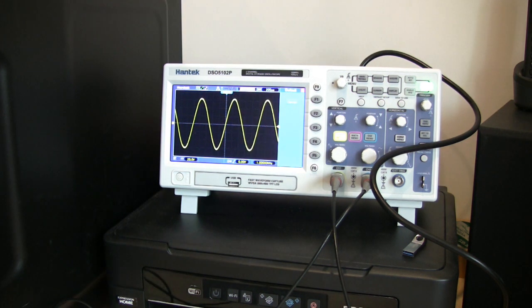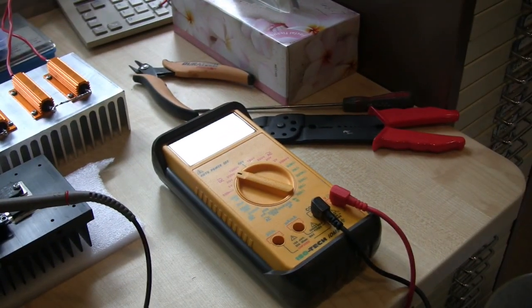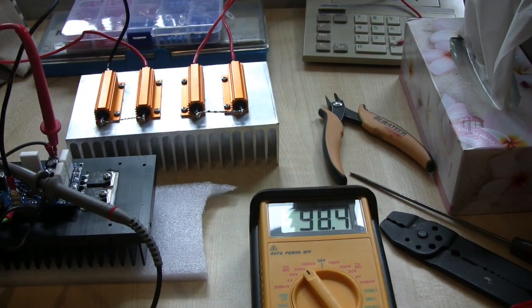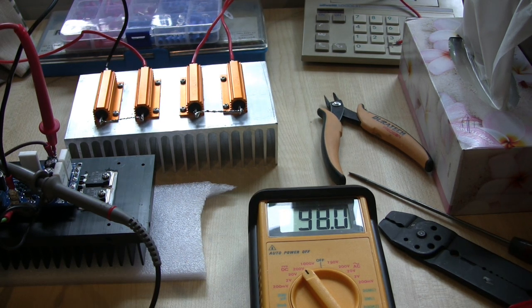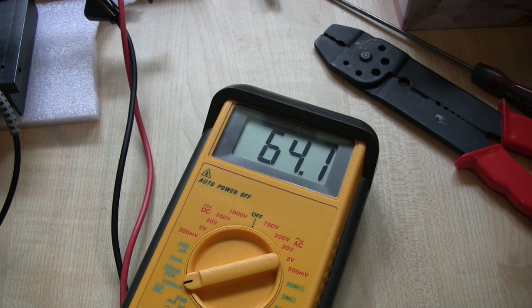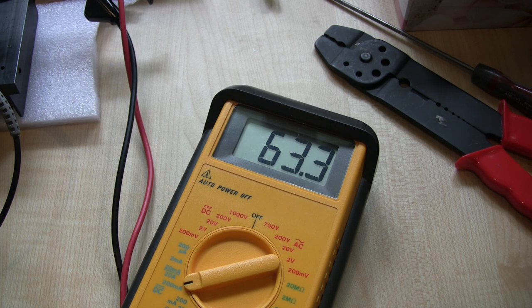That's very encouraging. Looking at the meter — 98, 99 volts — well that looks pleasantly encouraging. All seems to be okay. I've removed the signal and this is the quiescent current on the plus side, and I've also checked the other side off camera because it's exactly the same except it says minus on the meter. I would say that's a fairly acceptable quiescent current.